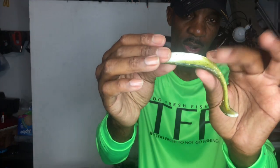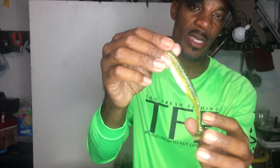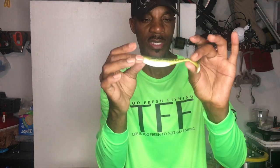I'm going to give a quick overview on how to shoot these. One thing I can say I've dealt with while shooting them is the white tends to bleed into the baby bass colors. I've had to do a lot of adjustment using the Dead-On plastic on getting the temperature right. Even at the lowest temperature I've shot — about 285 degrees — I was still getting some bleed in the white. I'd really like to get a solid laminate, so if anybody has suggestions on how to get a very solid split within the colors and laminates, feel free to shoot a comment below.